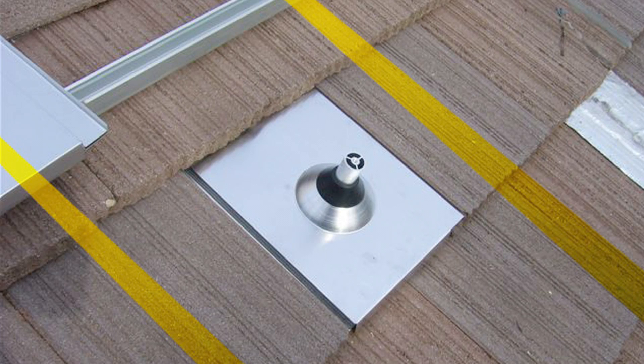And finally, certain mount types like our specialty flat tile mount require that the roof attachment be positioned directly in the center of a tile. Rarely are you going to find your rafter positioned right in line with the center of the tile, and as such you would probably need to install wood blocking so that you have an attachment point positioned directly under the center of the tile.